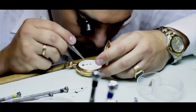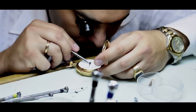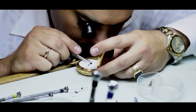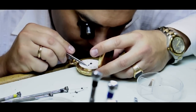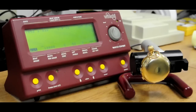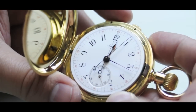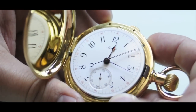After the individual pieces are restored, the parts are completely ultrasonically cleaned and dried, then individually oiled and reassembled. Once the mechanism is complete, it then goes through several days of quality control where we test the timing function of the watch and all other functions of the mechanism — in this case, the split-second chronograph function.